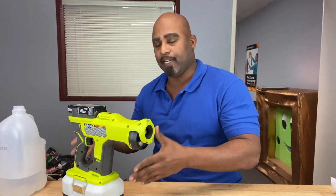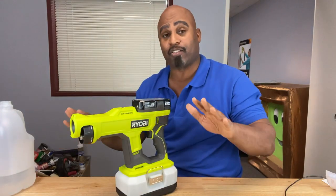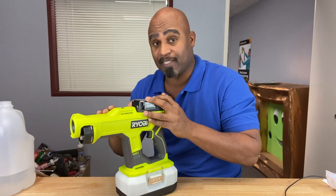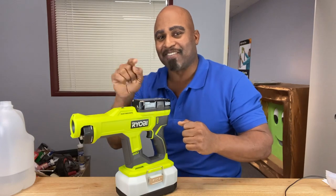You also want to clean your sprayer after each use by removing the nozzles and O-rings, soaking them, and then reinstalling them. Then take some clean water, put it in the tank, and run the machine for about one to two minutes. Use an electrostatic sprayer to disinfect your surfaces and sanitize your environment. If you learned something about this device today and found value, hit that like and subscribe button, and I'll see you guys in the next one.